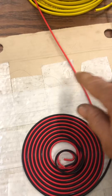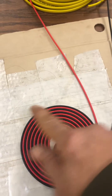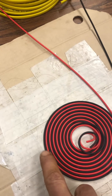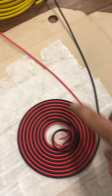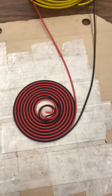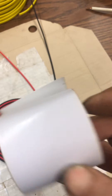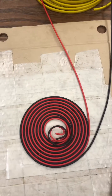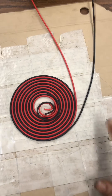And the same with these. Once the conductors end on the outside of the spiral, I'll just fasten a drop of glue, bend the tip up, and the same with the other one. So there's just a video of basically how it's wound. I'm using two-face carpet tape just on a piece of cardboard. You can see I've used this several times to make coils.